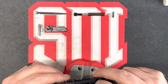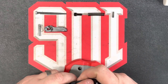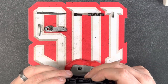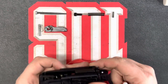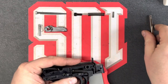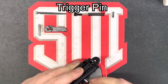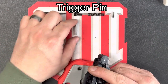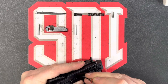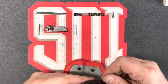All right, let's just take a quick look here. We're paying attention. That's still under tension. So there's two springs left in here. Let's go ahead and think, if I pull this spring or this one here, we might need a slightly smaller punch. Let's see if this one's any smaller. Yeah. We're gonna go ahead and pull out this pin, which looks like the pins are different size, so we need to make sure we pay attention to that. Okay, that allowed our hammer to come up.